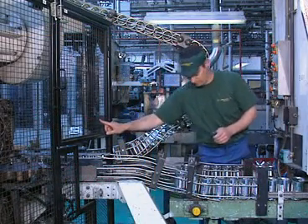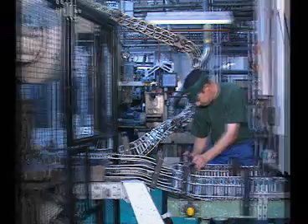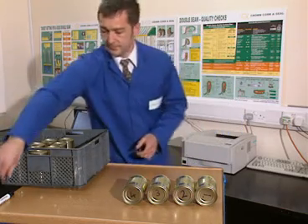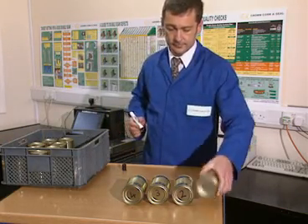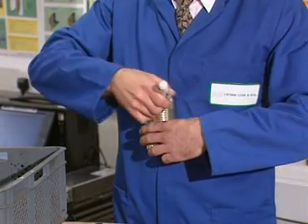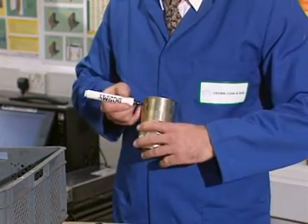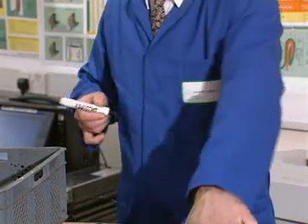For the finished seam, consecutive head-numbered cans are collected. Care must be taken to ensure can and head numbers correspond — often this can be done automatically. Mark a minimum of two positions on the seam, ensuring subsequent checks will be taken at these points. For two-piece cans, these two points are at any position around the can but diametrically opposed on the seam.